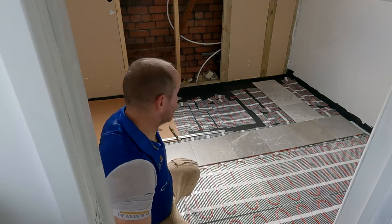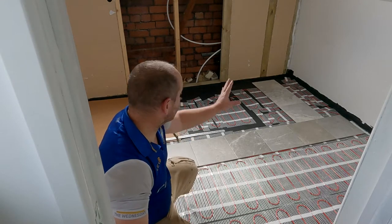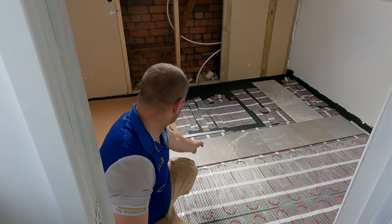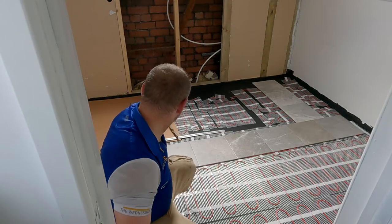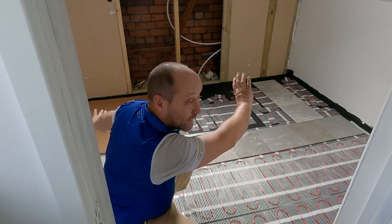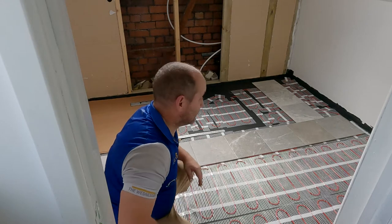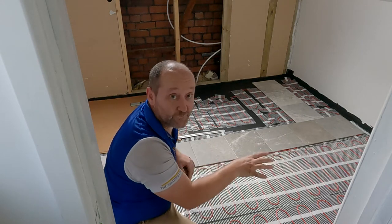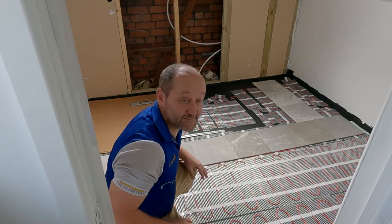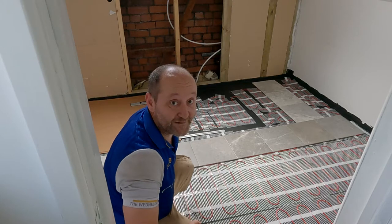However, this is a shower tray with drops. So what I'm not going to do is do that corner and work along, because then these joins won't line up. What I've got to do with the shower tray is go straight that way and then work outwards, and wash the problems into the corners. Partly because we're going to be boxing these two corners, there's going to be a sink under here, so it kind of hides details. But if you don't, you'll wash a problem into the middle and then you'll see it.